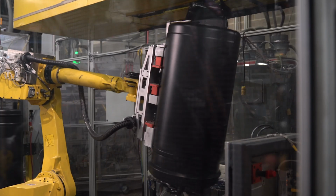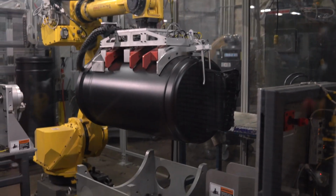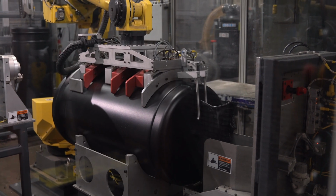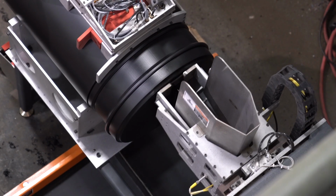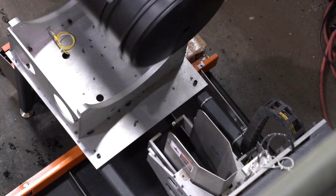In the blow molding, you're kind of chasing the part around. If the part will change throughout the day, we wanted to be able to use a robot that could handle those changes. With the precision of the FANUC robot, we needed something that would give us enough window that it would be able to trim the parts the way we need it trimmed as they change.